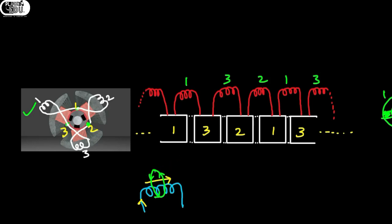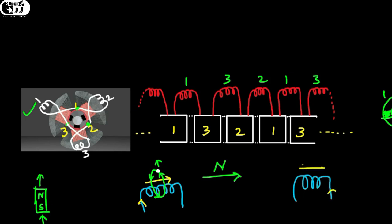For the explanation I am considering a point at the top of that circular field so you can know how the magnetic fields are coming out from the point. The magnetic field lines are outside. Considering a magnet where field lines come out from north and enter through south, we can write the point as north. So if the current direction is from left to right, the magnetic polarity will be north. Similarly, if the current direction is from right to left, the polarity will obviously be south.